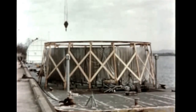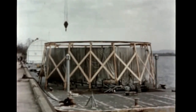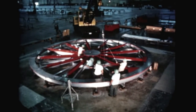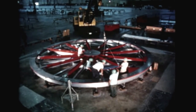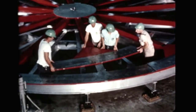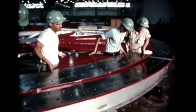The first inner tank, which was a half of an inner tank assembly for the test fuel tank, has been completed and shipped to MSFC. The forward handling ring will be assembled in a fixture at Michoud and will be used in assembly and transportation of the major components of the S-1C stage, becoming part of the transporter for the entire stage.